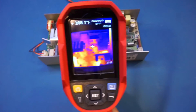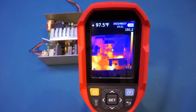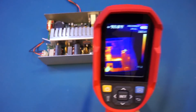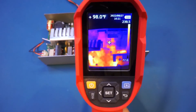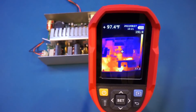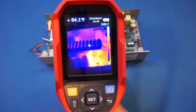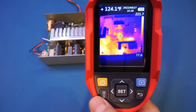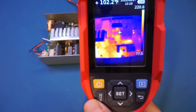This is definitely a great thermal camera for troubleshooting circuits. If you look, the image doesn't move as smoothly as I would have liked given it's spec'd at 25 frames per second — it probably isn't quite hitting that. There's a little bit of lag when dragging the camera across the surface. Once in a while you'll also hear a clicking sound — that's the thermal sensor being calibrated, which is fairly normal for IR sensors. You can get a rough idea of the temperature of each component via the crosshair in the middle.